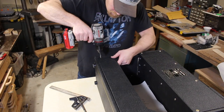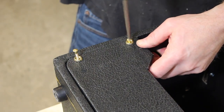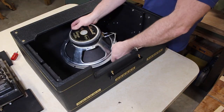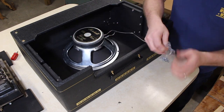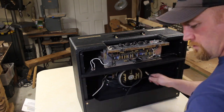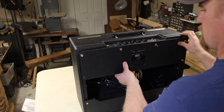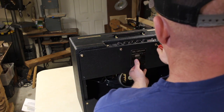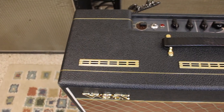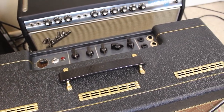Now we're getting to the final stages of putting this together — you can see the top panel and bottom panel, and the details of putting brass screws in the back with some finish washers. The back panels are both made from the 3/8 inch birch plywood. I'm installing the speaker to make sure I get a good test fit and test out the cabinet to make sure it sounds good with no weird vibrations anywhere. You can see how the tray slides in and the back panel holds it in place. That Vox amplifier tag on the back is the real deal — an AC-30 tag from the old cabinet. So here it is, all cleaned up, ready to ship back to Zach. Make sure you check out Zach's video, where he goes through the history of these amplifiers and you get the treat of hearing him play through this amplifier.